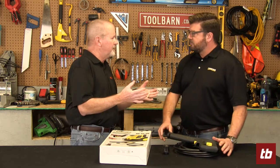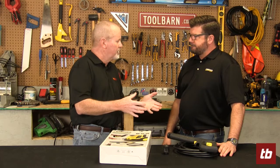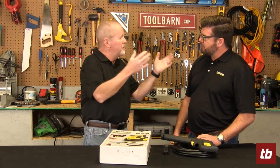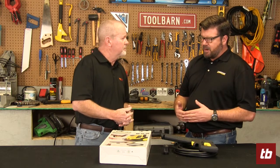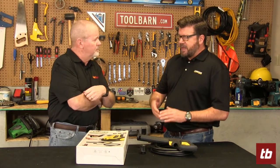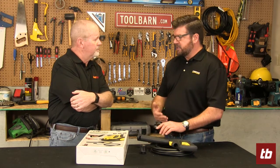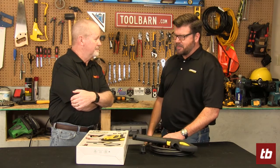That's a good deal because people don't like to throw away stuff that works just fine because of a minor connection change — kind of like not having to buy all new earphones for your iPhone. This is a very economical way to get your pressure washer back up and running. Sometimes a hose fails because it's stored in the shed and a squirrel chews through it. You can fix it very economically with this kit and bring it into quick-attach, since those older hoses are sometimes hard to attach to the guns.